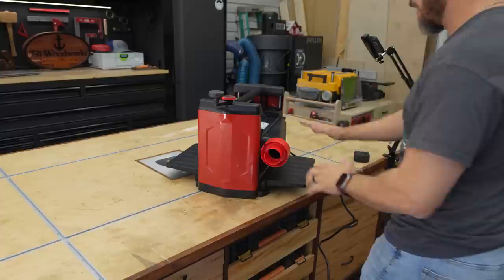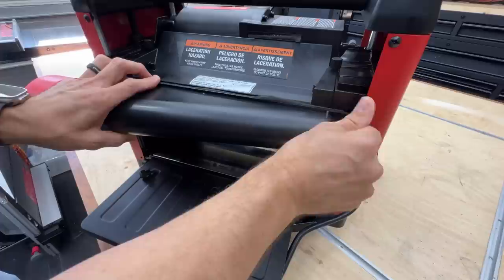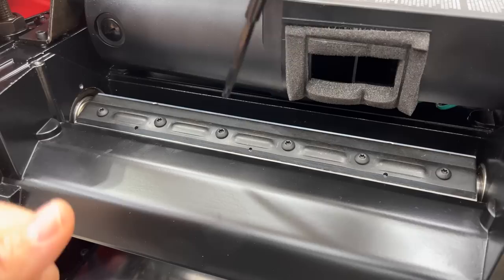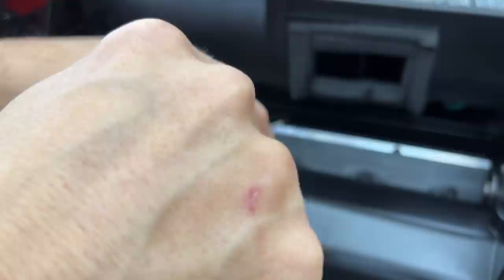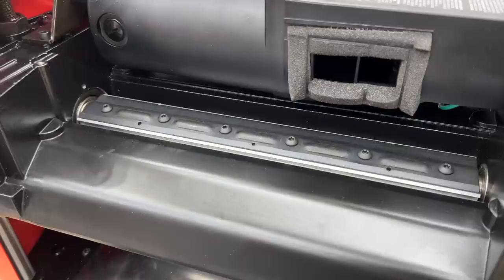It has a dust cover on the back that easily comes off with two thumb screws, should you get something jammed in there — especially epoxies, which have a tendency to cause clogs on planers, even my DW735. Speaking of blades, those two thumb screws come right off, you lift this panel and access the blades right there. The wrench takes this piece off so you can switch the blades out, and they are two-sided blades, so you can flip them and reuse once one side gets dull. These are very sharp, so be careful. This is a two-blade planer, which is a trade-off at this price point — anything with three blades, a helix head, or spiral head will cost significantly more.